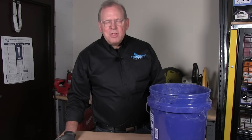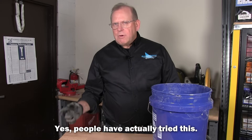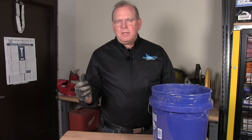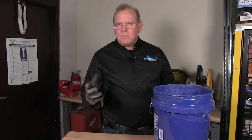A final tip: cleaning. Do not clean concrete buckets out in your slop sink, your toilet, your regular house sink, or your bathtub — don't do it. Clean it outside with a hose, in your grass somewhere you don't mind. If you clean it in your sink or bathtub, the trap in the plumbing will collect the concrete sand and it will set up in there. The end result is it will reduce the water flow by a substantial amount, eventually clogging your sink. Hair will cling to it. A lot of people do this — it's a big mistake. Don't do it.